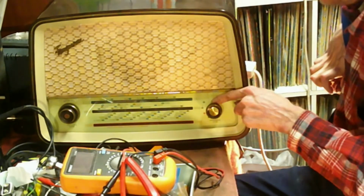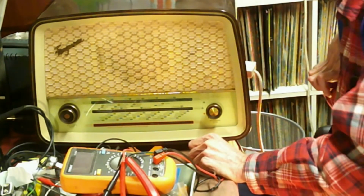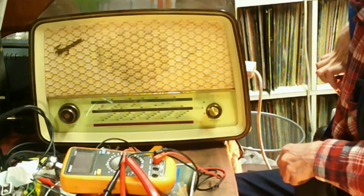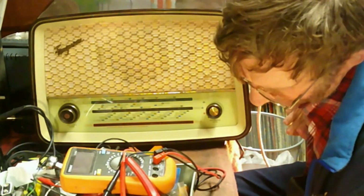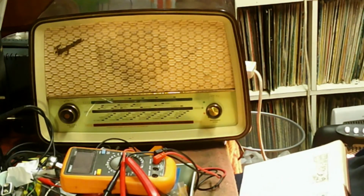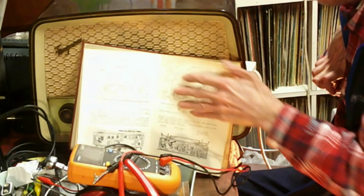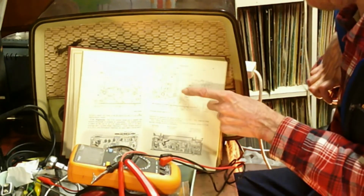One thing with this, actually, the wave change which is missing, if anyone's got one, I would be very grateful. I'll look on eBay, but there's not a lot wrong with this. With these sets, generally speaking, there isn't. Just capacitor changing. Only two capacitors in this. I know you could do things, taking resistance and that, but one resistor did fail actually in this, which I've replaced. Basically, with this unit, the smoothing caps were faulty. The reservoir cap, which I've changed and put underneath, and a 100 ohm resistor in between the two reservoir caps. We've got open circuit, that one there, you see that, and of course the usual capacitor, which must be changed in every set.